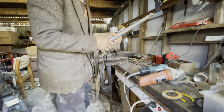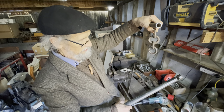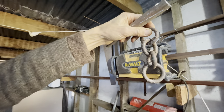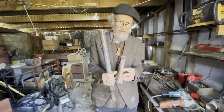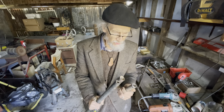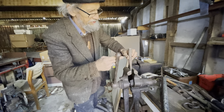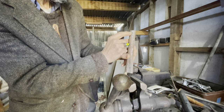I've got a short length just for demonstration. The tools I now use for a tight ring — as a spoiler, if you're not interested go no further — but this is what we can make, and I'm estimating about a minute per length. They're very neat. I'm going to use some of that for our hanging sign to support our shingle out the front. The tools are a bit of one-inch and a one-and-a-quarter, 25 or 30 mil pipe. One is the lever and the other is the post which we turn the rebar around. It's flattened at one end and has a hole in the other end, about 12 mil, nearly half an inch.